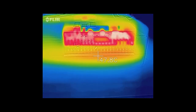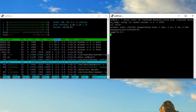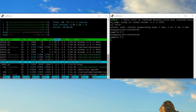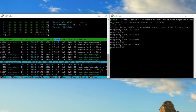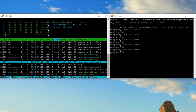Now test number 2 — pedal to the metal. Using the test method from Core Electronics adjusted to the A7 CPU, with a built-in temperature display, all four CPUs are loaded to 100%. The temperature immediately increases and passes 80 degrees. Then throttling starts and reduces the CPU frequency, and temperature stabilizes at around 83 degrees. Good news: the self-defense works. But I stopped the test because a Pi is too expensive to kill.